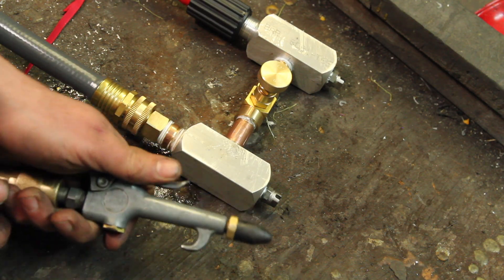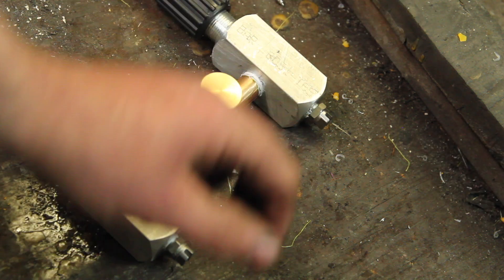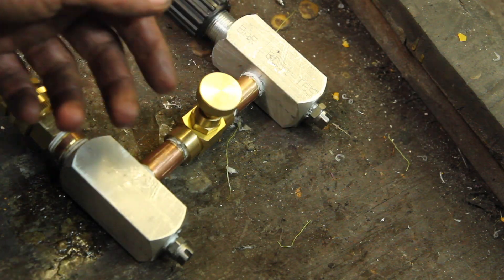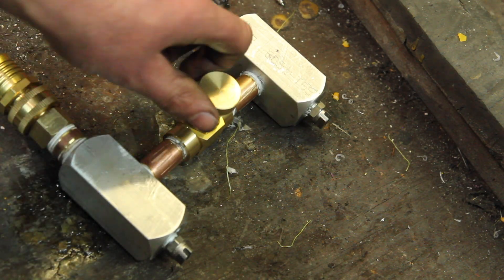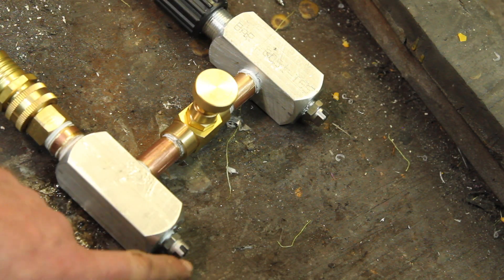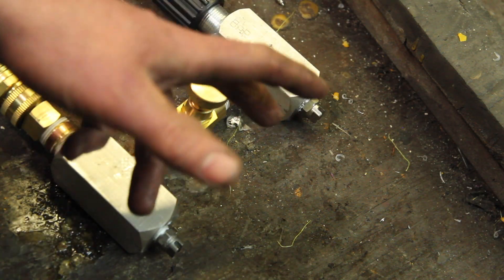We're going to use that to our advantage here too. If we only sprayed high-pressure water out, it would probably super-cool without freezing until it hits something like the ground, in which case instead of making snow we're going to make an icy mess. So what we want to do is run a little bit of that high-pressure water into our airstream, which is what this needle valve controls. It hits the airstream, which cools very very rapidly to a very low temperature. A very fine mist will freeze, and those ice crystals will be the nuclei that mix in with the other water stream and make the snow.